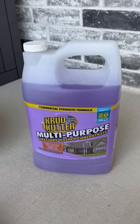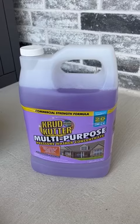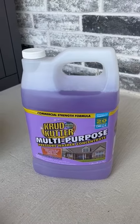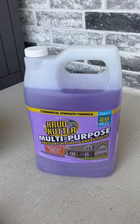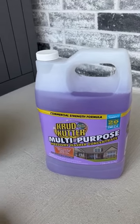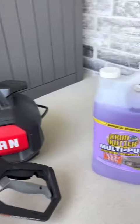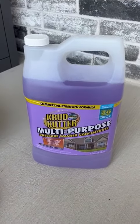What you need to know about it is you mix it with water — it's about a 1 to 19 ratio of the solution to water. So it only takes a little bit, and you mix it together. You can either use it in a spray bottle to spray it on the surface you're going to clean, or if you have a canister that attaches to your pressure washer — I don't have it attached right now — you can pour it in there and it just mixes with the water as you spray it.